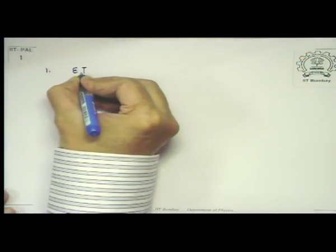One thing I repeatedly want to point out: electromotive force, or EMF, is not a force. What it does is to raise the energy of the positive charge carriers by taking them from a lower potential to a higher potential, and the amount of work that the EMF does is the EMF multiplied by the current that it provides. The EMF is measured in volts and I is of course in amperes.